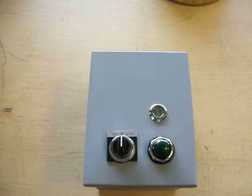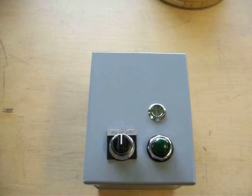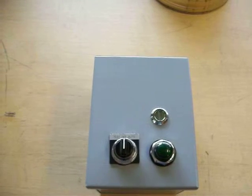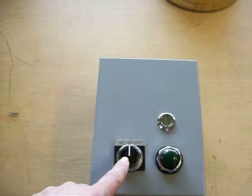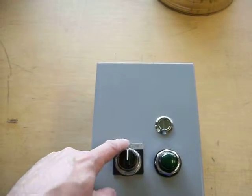This is Moose here showing you our one-third horsepower, six-amp fused hand-auto-off, or HOA, contactor. We've got a three-position selector push-button switch — Cutler Hammer — with test or hand, off, and auto positions.